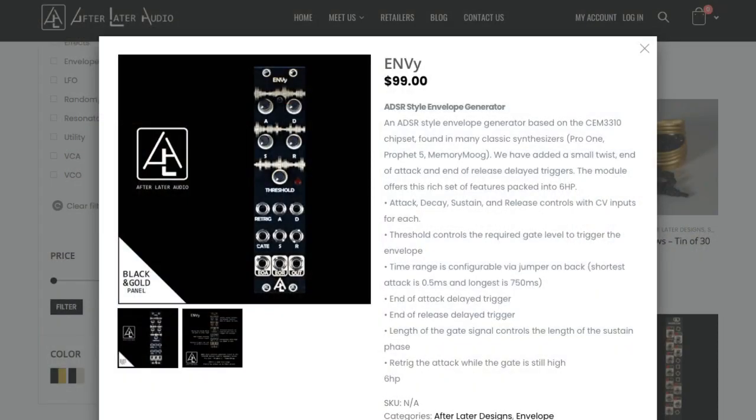But then also the filter is the same, so it essentially integrates the OTA capabilities that you need to drive from a filter perspective into an entire filter chip, where you can effectively pick the frequencies and pick the routing between the various stages of the filter, which again makes for a super dense module and enables this highly packed functionality here. And then the envelope's the same way, where it exposes all of these.